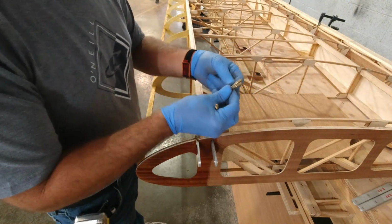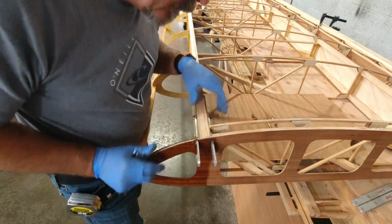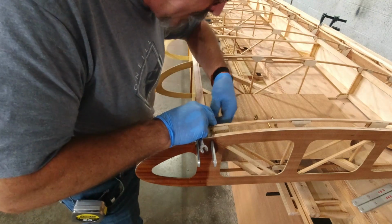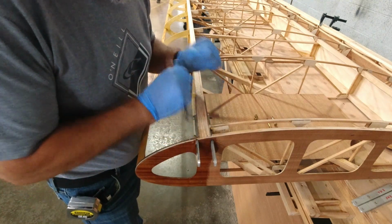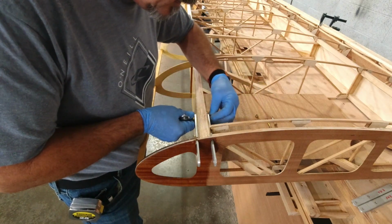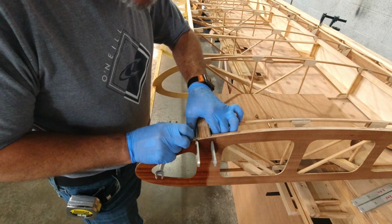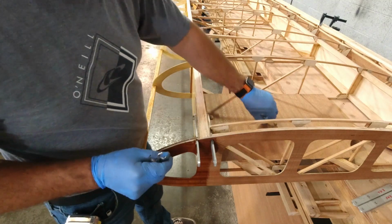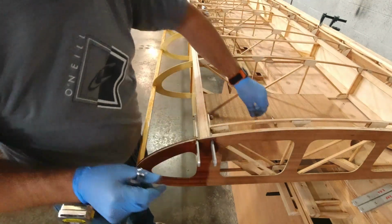I've got a couple 4-17s, so I'm gonna give those a try instead. All right, so I put in the 2 17s, and obviously with the 17, the important thing is that I still see thread at the base of this piece, because you don't want to get the nut tight and then have the bolt rotate. So we'll see if it tightens up well, and go from there. Right now I see thread, and it doesn't appear to be a problem. What I'm mainly concerned about is I don't want to see any of the shank sticking out of the other side. I want to see nothing but threads. So all right.